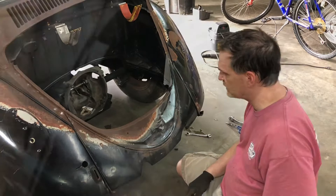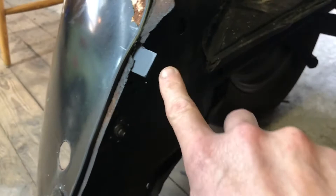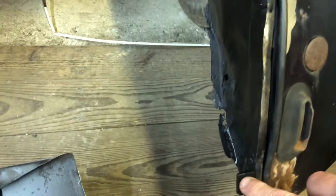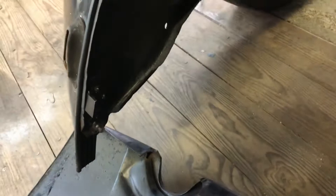Now the top will fit in like this and drive right back down into place and set in there just like that. I took four pieces of one-by-one angle iron, roughly about one inch long, and got them in four different corners. I took a welder and came in on the inside, tacked it up good and firm on all four points, wire-brushed down the welds, and then spray painted them with some primer and rust killer.